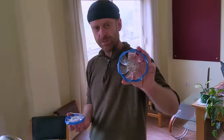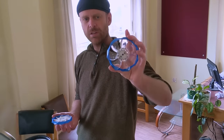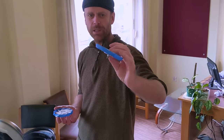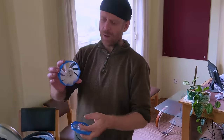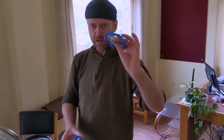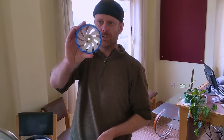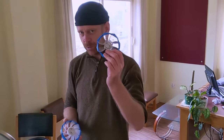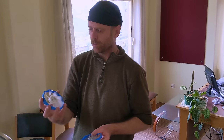So these — this is more like the kind I've been using so far: seven blade, reasonably flat pitch, fairly hefty. These are like the ones I had in Berlin when I was getting around 200 watts — pretty much the same fan. This type is just what they had; I only managed to find this recently. Most of them I've seen are this nine-blade type — a lot weaker and a bit steeper pitched. So I have no idea which is going to be better. I'm thinking probably this one, but I'll try both and just see what the numbers look like.